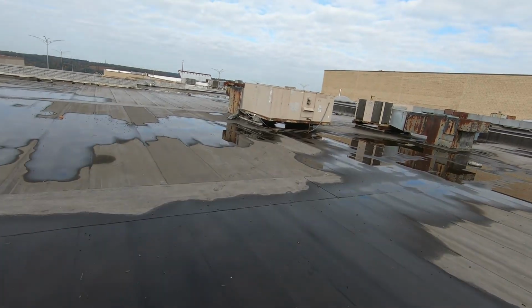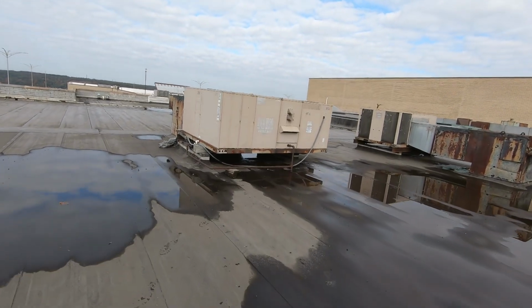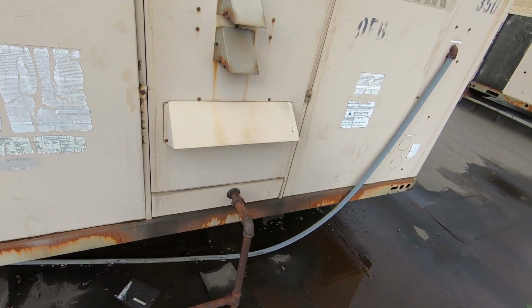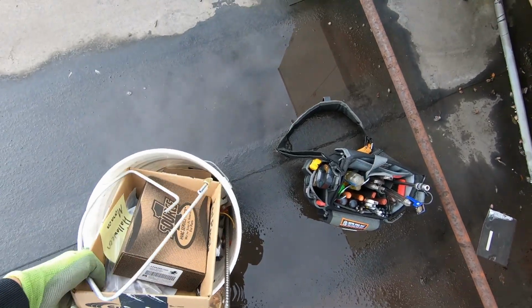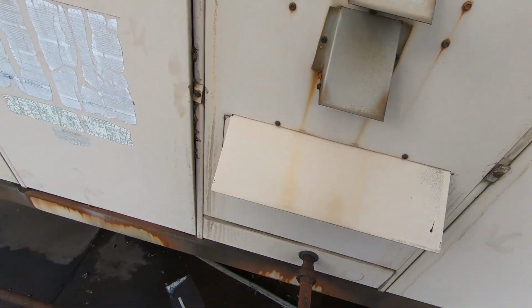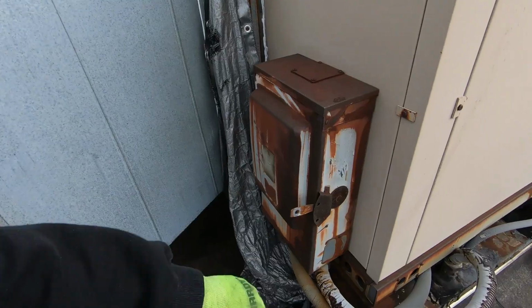Doing some repair work today. I didn't write it up. I don't know anything other than these are the parts that are going on. Apparently it's flame sensor, igniter, ignition control board, carryover tube, all the good stuff for a York unit. So I'm gonna pull this crap apart, replace all those parts, get the heat going.